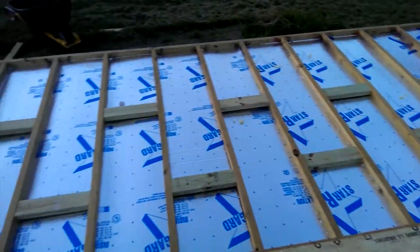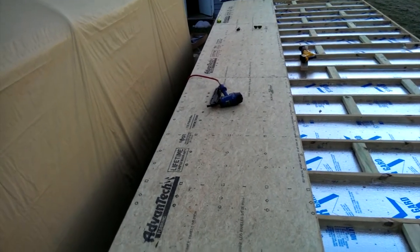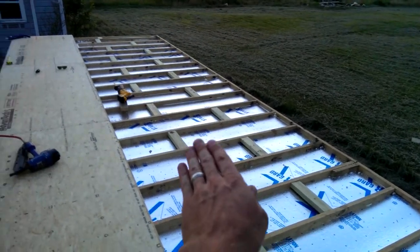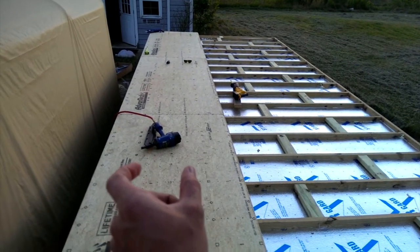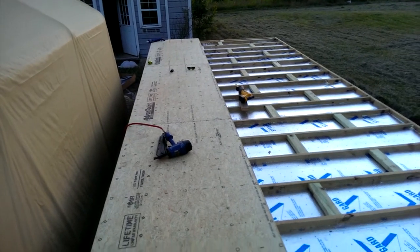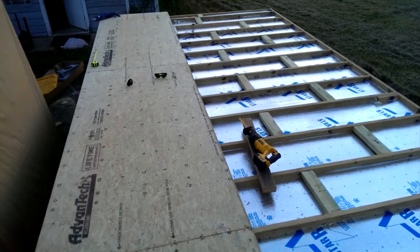We've gotten the Advantech flooring down on one part. We just have it overhanging here and we're going to cut it off with a circular saw — it's about 18 inches of overhang. We'll have a full-width piece here and then another 32 inches. We didn't want to start with a full 48-inch course, then another 48 inches, and then have only about 16 inches left hanging over the edge. Doing 32 inches, 48 inches, 32 inches is structurally better. There'll be some waste, but this is the foundation and you really don't want to take any chances with it.